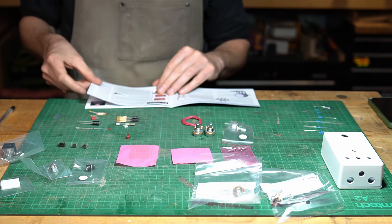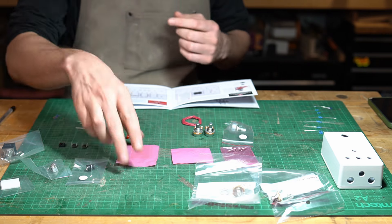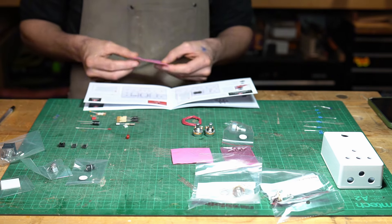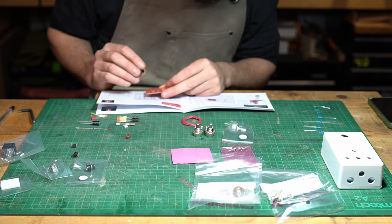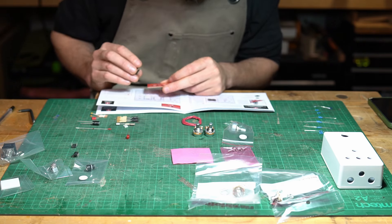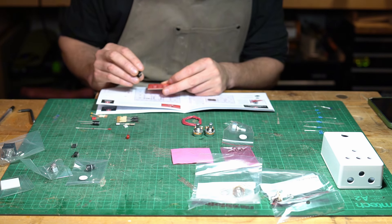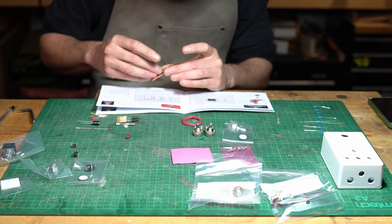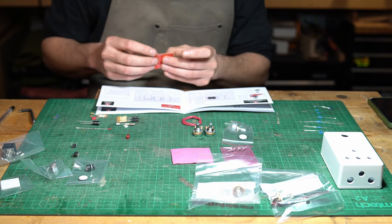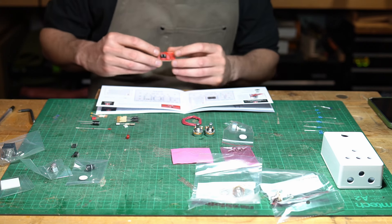I'm sure many people in the comments will chastise me for my soldering technique — that's fine, I have no real clue what I'm doing, but these kits are all about learning. Alright, we're actually going to get into this — wow, this is not the same size I expected, it's going to be fiddly but we're going to have fun. I really like how clear these instructions are. Orienting the chip is also critical: the small dot on the upper left corner is installed on the same end as the U-shaped cutout. So we're going to carefully do some careful snapping — and that feels to be a careful snap.